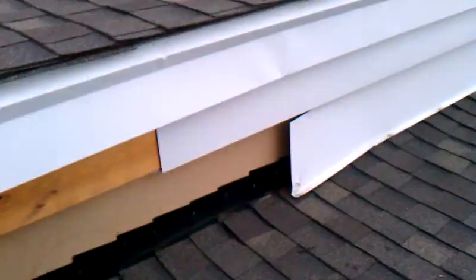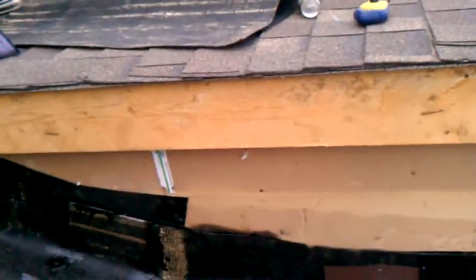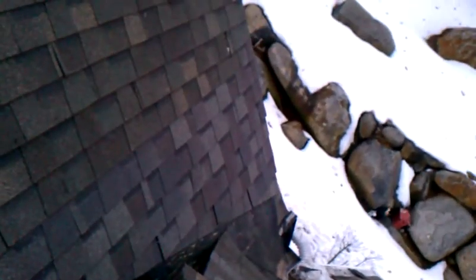I don't know why they call it rubber. But as you can see, we removed all the metal trim or siding, whatever they call it, and we flashed up underneath and we ran our rubber up under the shingles and they re-shingled the valley. You can kind of see where we re-shingled. We also fixed the neighbor's leak, which is underneath this material right here, so I guess they got a free repair.